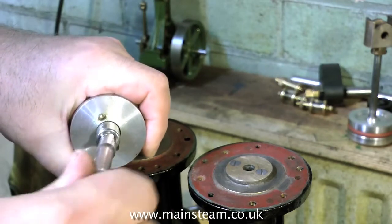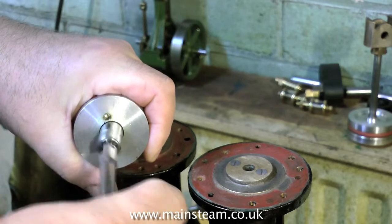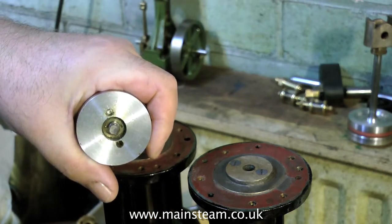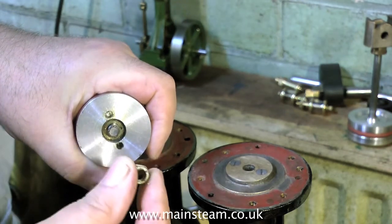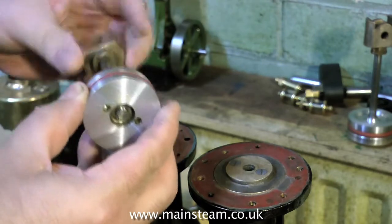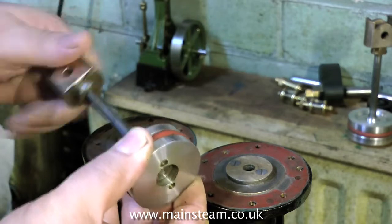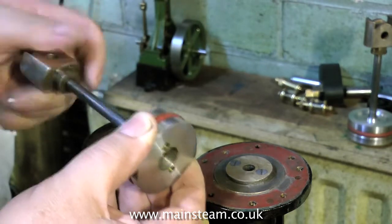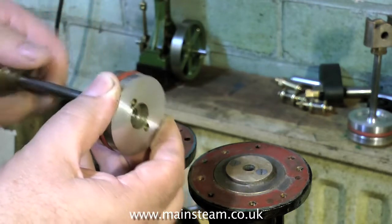As I'm now going to fit the piston rod and crosshead to one of the standards, I do need to remove the piston. I've undone the nut and then the piston itself is also threaded onto the piston rod. The piston unscrewed very easily from the piston rod. When I refit the piston I'm going to nip it up a little bit tighter by using a pair of circlip pliers on the two holes at the top of the piston. So here comes the piston rod separated from the piston and we can carry on from here.